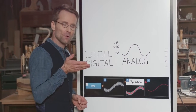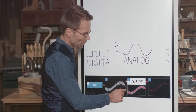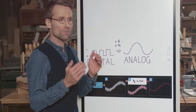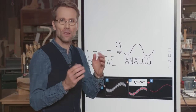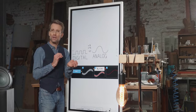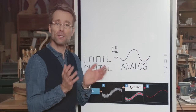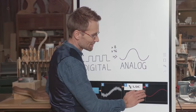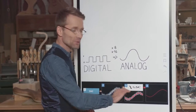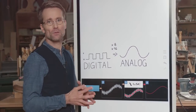So what we've created is the following. We are following the vector — the direction of the waveform — and analyzing that in real time. By following that waveform, we can ignore all the pulse noise around it, because the pulse noise, simplified, is a bump of plus one to go up and a bump of minus one to go down. From the direction of the vector, you can ignore that pulse noise information completely. The result is a clean waveform, generated by analyzing the actual shape of the waveform that came out of the DAC and ignoring the noise completely.